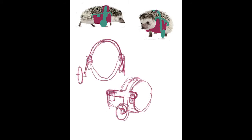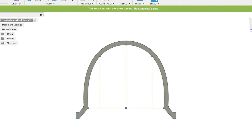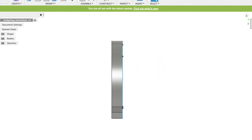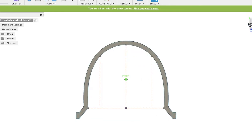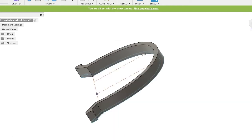I used the 3D modeling software Fusion 360, where I was able to design the outer frame to curve around her body. The frame has two spokes on the sides to attach the wheels to. I made it at about half an inch in thickness so that it was still thin and lightweight, but had enough support to hold Molly's weight. The frame was modeled to have wheels at the bottom, and everything was rounded over to make sure there are no sharp edges.